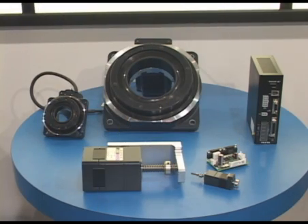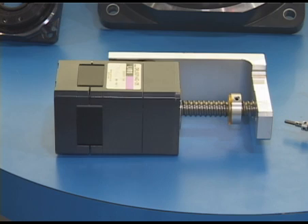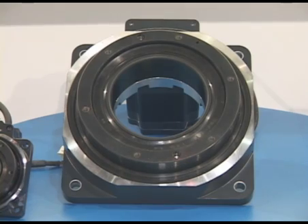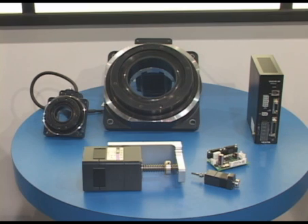You're now looking at the rest of our linear product line and rotary actuators. To start out with, we have our DRL, which incorporates a ball screw that runs through the interior of the rotor, allowing for very precise linear actuation. Next, we have our DG series, which allows for rotary actuation with a very large hollow shaft, providing direct drive for those rotary actuator applications.